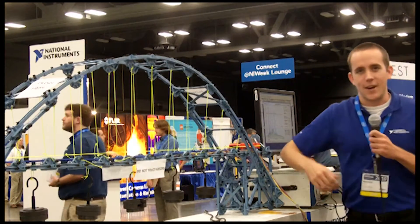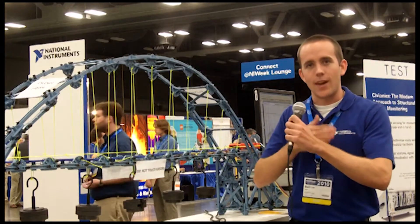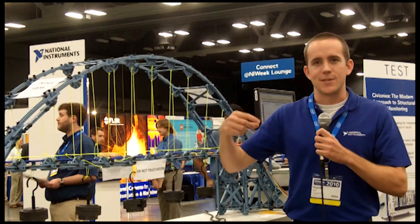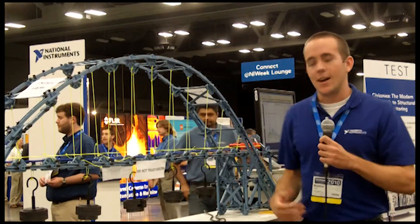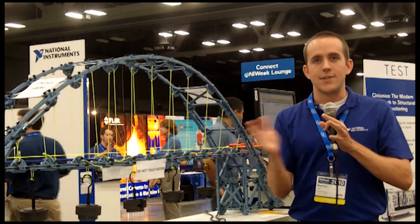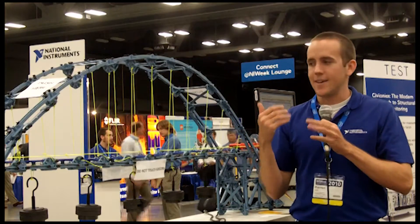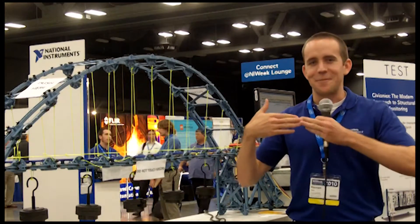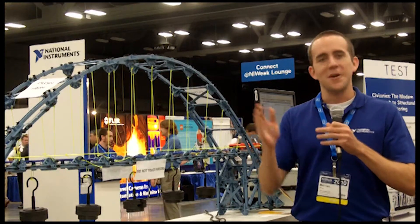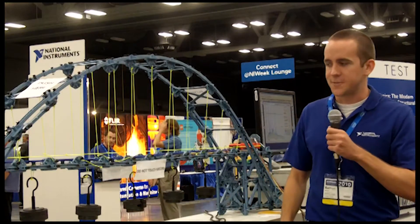That works off of a technology called Fiber Bragg Grating, where little gratings are embedded in the fiber at the points for each of those sensors. Those gratings for each sensor are tuned to different wavelengths. So our interrogator scans across an 80 nanometer range of frequencies and picks up the peaks that each one of those sensors reflect back. As the strain gauges bend and move, those gratings spread and grow closer together, so the wavelength changes, and that's how we can measure the displacement on the strain gauges.